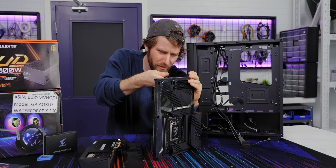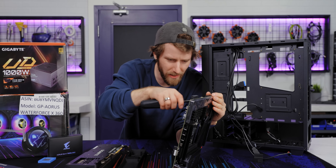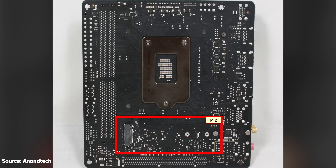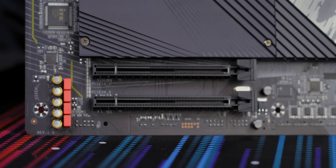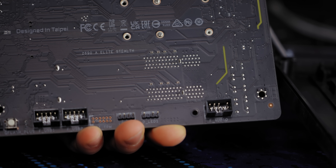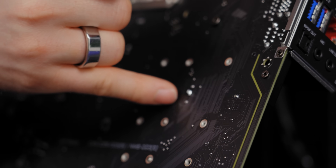I kind of want to pull off this shield and just see what's under it. It's like a Stranger Things thing. Everything's just through holes but they go the opposite way. It's possible this is totally normal and I'm only noticing because I'm looking so closely at the construction of this board, but the two PCIe Gen 4 slots down here are using through holes for soldering and the Gen 5 slot is actually surface-mounted.